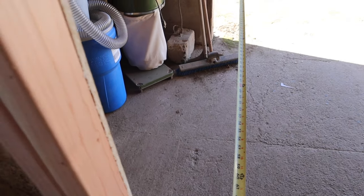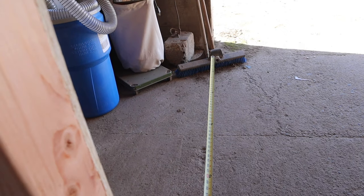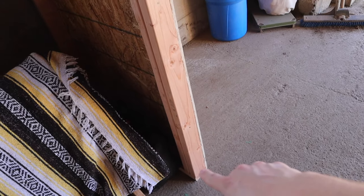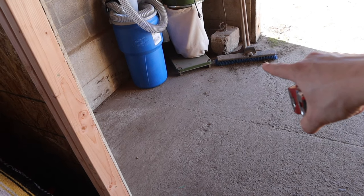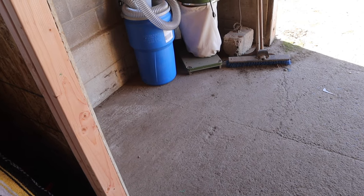On the bottom, I wanted to make sure I was off the ground. Take a measuring tape and check how far from your hinge point the door sweeps out across the concrete. Get real low and look for any bumps. The right way to do it is to take a string level with a partner, string it out about a half inch to an inch off the ground, make sure it's level, and check for any high spots right where the end of your door will hit. In my case I ended up going one inch off the ground, and I'm planning on putting a bristle door sweep on the bottom to take up any remaining tolerances.